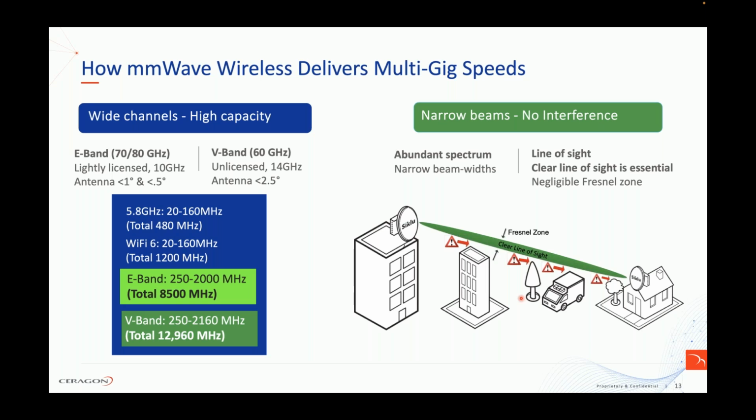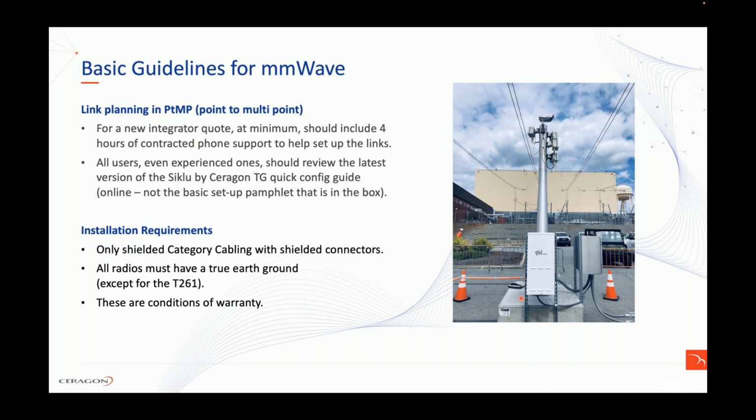In one band of a Terragraph channel, which is 2,160 megahertz wide, that's more bandwidth than is contained in all of sub-6, including the new 6 gigahertz channel, just in one of our channels, okay? That's the reason. Tons of spectrum. You've got pinpoint accuracy with really small Fresnel zones. Even on scanning antennas, you've got incredible accuracy, okay?